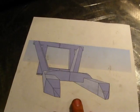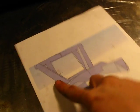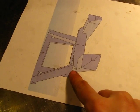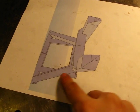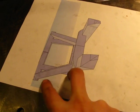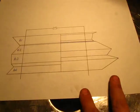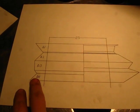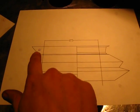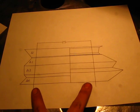I did it up in Google Sketchup first. For this diagonal, what I could do is measure the length of each line and each corner where it wraps around, and get all that information and those numbers off of there after getting the position exactly where I want. Then from there I can lay them all out and measure across. In this case I actually printed it to scale, or at least these end pieces to scale, and just spaced them the right distance apart from each other.